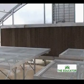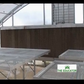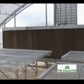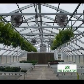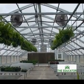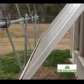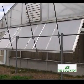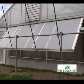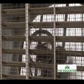The evaporative cooling system is comprised of a stainless steel trough and top cover plate. The system comes with a submersible pump and float valve that maintains the proper water capacity and water level at all times. A sump pump is not required because the cooling trough doubles as the water reservoir tank. The automatic wall vent located behind the cooling system provides an adequate seal when the evaporative cooling system is not operating. The slant wall fans are properly sized to provide the proper air exchange requirements for maximum cooling efficiency.